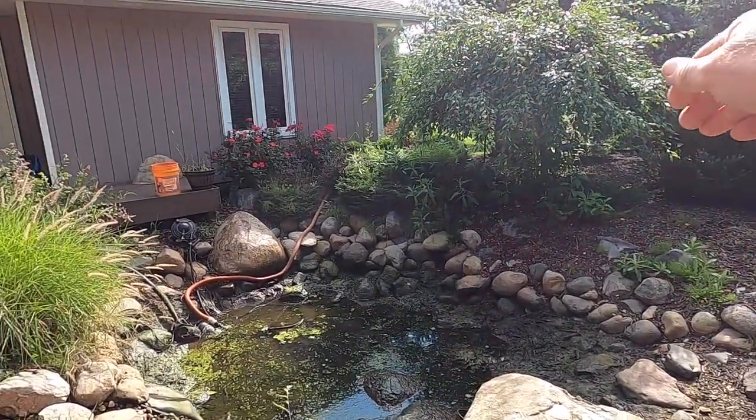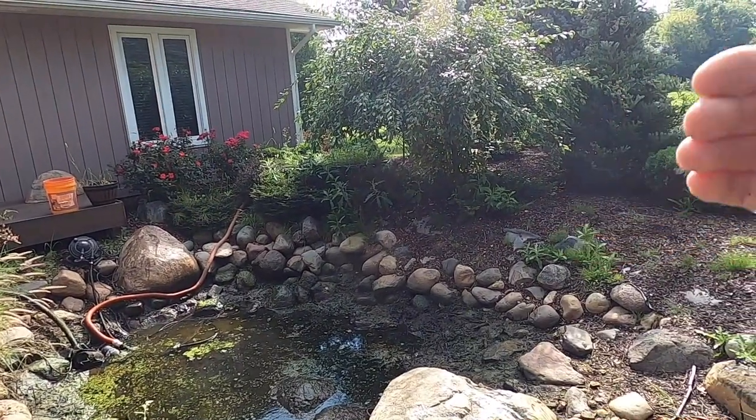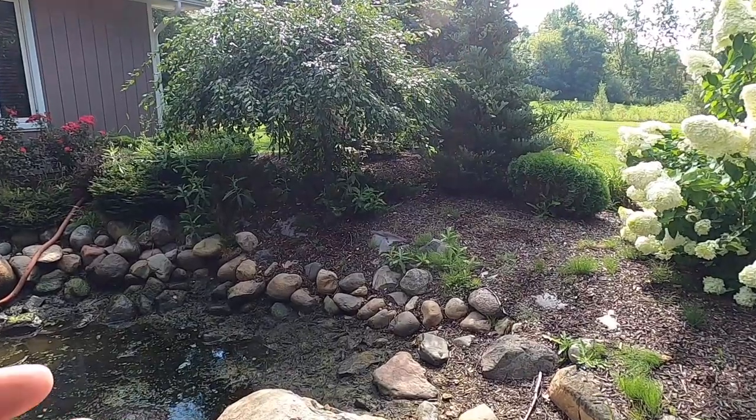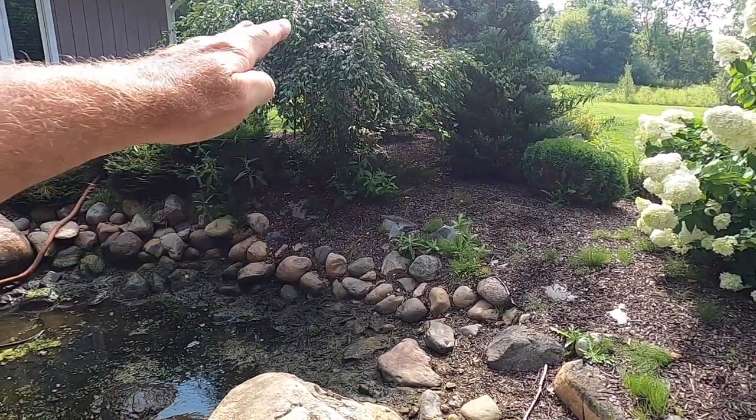And anytime it rains, of course, one of my pet peeves, landscapers or homeowners using weed barrier underneath mulch. On a slope, that just makes a slide. If you don't get anything else out of this video, please remember, weed barrier does not go underneath mulch. Weed barrier is for underneath gravel only. Mulch breaks down, it turns into dirt where the weeds grow. You got it, in the dirt. So enough soapboxing. And I'll show you what else we got a challenge of.